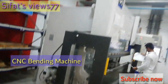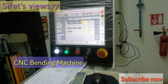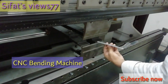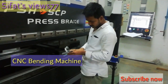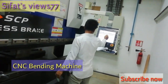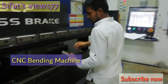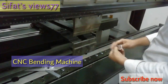This is our other bending machine — one is from Germany and another is Legia, which is from China. The bending operator is making the program. He will put the parts into the die to achieve the right dimension. If the dimension is not coming correctly as per the drawing, he will reprogram it and put the part into the die again until he gets the proper dimension specified in the drawing.